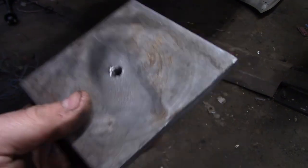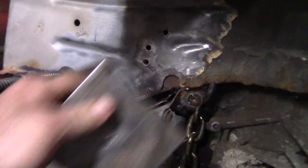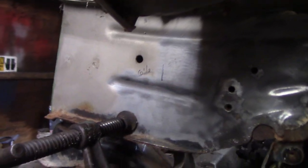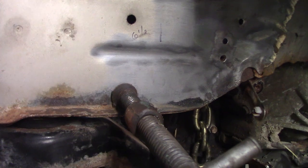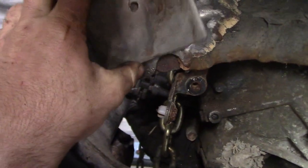I remember why I got all these plates for free from the job site — they're four inches one way and four and a quarter the other. We ran them through the bandsaw, cleaned them off, got the frame cleaned up, and marked six and a half inches from where that front plate comes back. At six and a half inches is where the bumper plate goes — well, six inches, but then you need a half-inch gap.